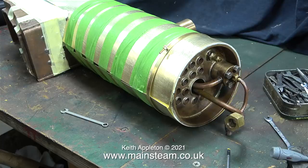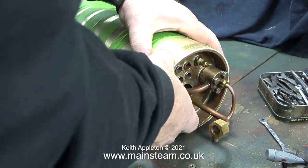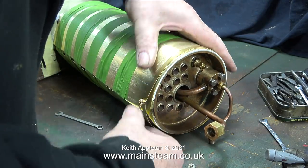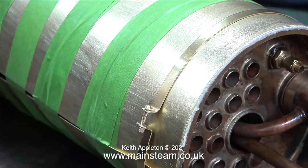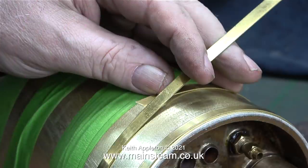As you can clearly see, this first boiler band is far too big — even when the ends are held very close together with the nut and bolt it's still a rattle fit. The problem is that the end of the cladding sheet is very springy and sticks out too far, which is why I got the wrong measurement for the length of the boiler band. It was not a big problem — I chopped off one end, re-drilled it, bent it over, and now it's a good fit.